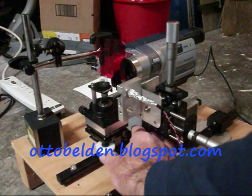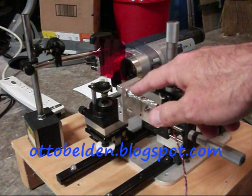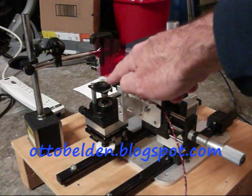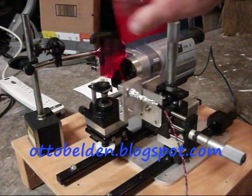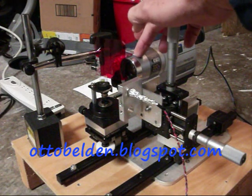I set this in front of the light source — the diode. I've also used a laser in here with some lenses, but in this case it's a diode. It shines off the mirror. Half of it goes straight through, the other half bounces down that way. I use all these adjustments to align it coaxially with the view of the camera.